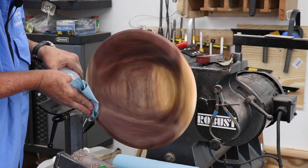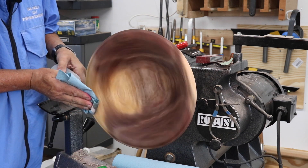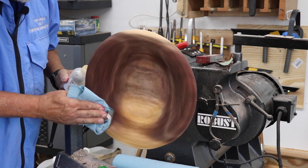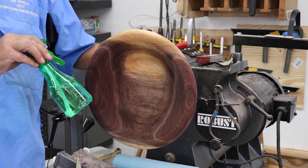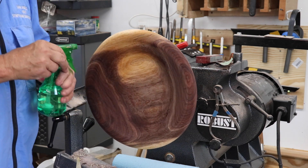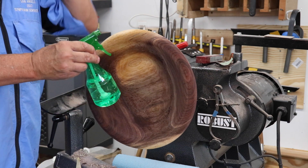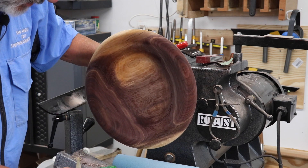This is just a lot easier — I think applying the finish on the lathe is a lot easier, and this will probably really soak in there quite a bit. Previously what I had done to get to this point was I sprayed some water on this and kept it in a plastic bag. I've been working on this for three or four days, just to make sure it didn't dry out and crack — I kept it moist. I've always got a water bottle nearby.